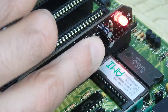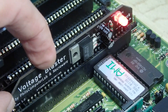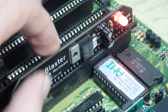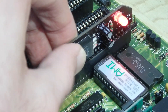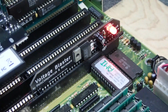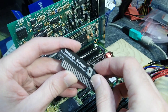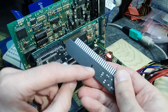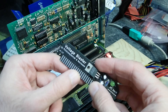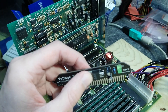Here you can see a setup that has been running for over two hours playing music — I can't even feel that the regulator got warm at all. It's barely one degree higher than room temperature. So no worries there. If you have a special case where you want to use multiple cards that all use minus 5 volts and all are hungry for negative voltage, then in that rare case you might be concerned. Therefore, the PCB already has a hole so you can put some thermal paste under the LM7905 and screw it to the board — the copper area below should be just enough to dissipate the heat.